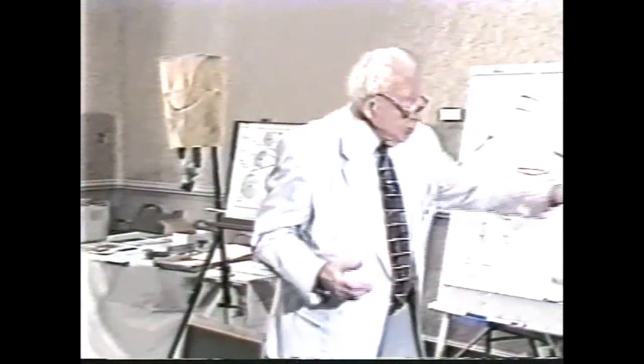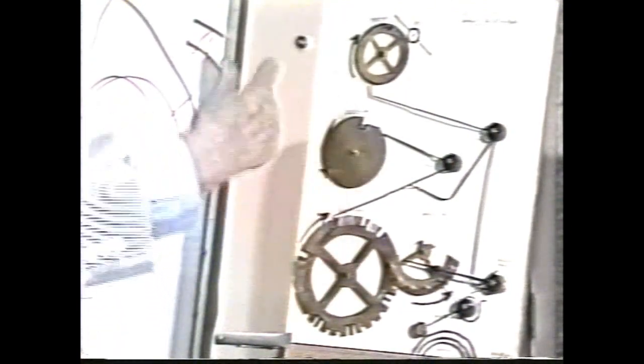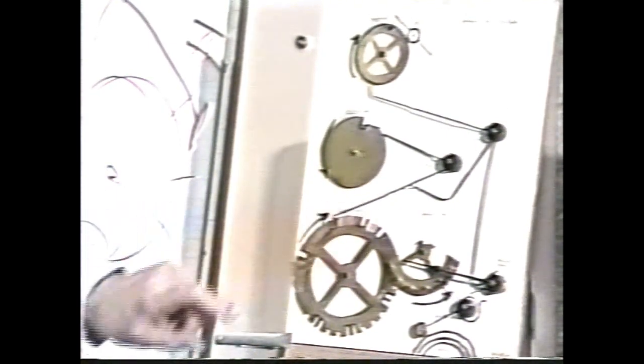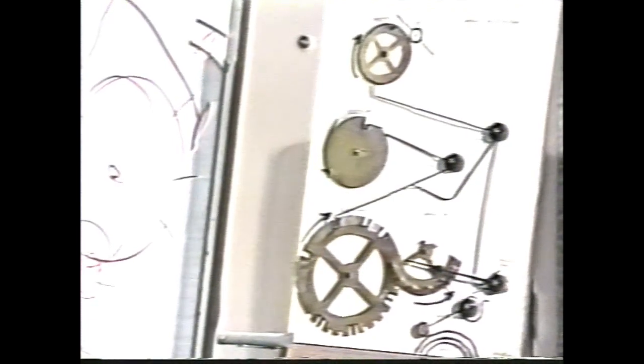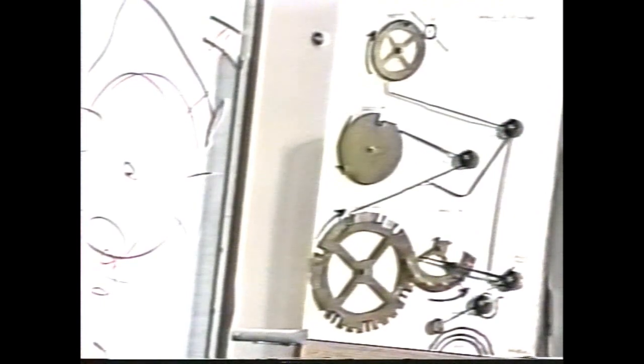Easy enough. You put teeth on this smooth rim count wheel, and you drive it with a pinion on the adjoining train. As I told you, all the other wheels are not there, but they can be placed anywhere the guy who designs the clock wants to do it. And on the arbor that's right nearby, you put a regular pinion on it, and you drive this new count wheel that has teeth on it. Take me a second, and we'll put teeth on that count wheel.